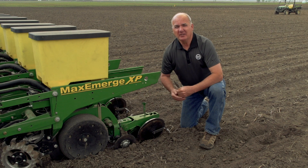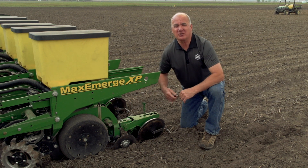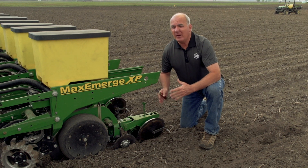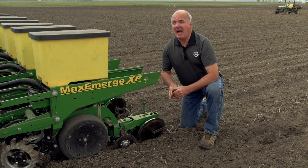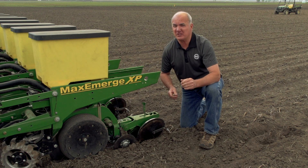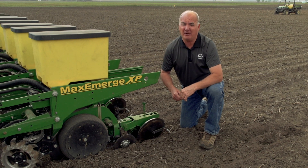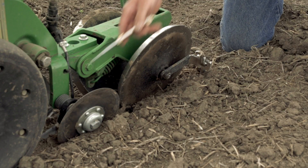By simple I mean we wanted to be close into the row unit — the way we designed and mounted it, we're only adding five inches to the overall planter width. The main thing was we wanted to do no harm. If we hit rock or stone or hard surface, I did not want this planter to lose planting depth. If we lose as much as a quarter inch in planting depth, that unit is very likely going to produce a barren plant — we've lost an ear, or about seven bushel for every thousand.